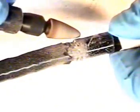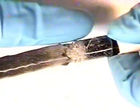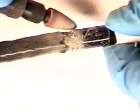If necessary, turn over the endoscope to be able to have easy access to underneath to file off the glue. Be sure when filing off glue to do it exactly in the same plane as the insertion tube and not to cut any deeper into the insertion tube itself.